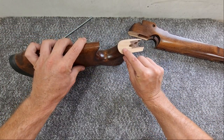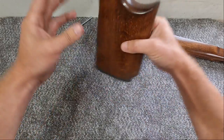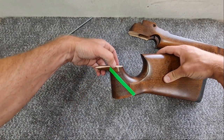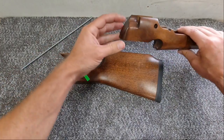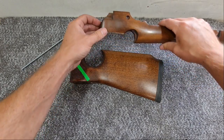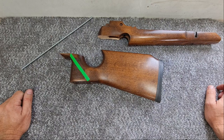There's not an awful lot of wood here with that grip fixing bolt going down at an angle - that's roughly where the stud drops through. So you can see here that I've only got maybe 20mm of wood to get a fixing into, which means I've got to be super careful that I don't break through this back edge. It's going to be fairly involved but I do like a challenge - I thought it'd be fun to film it; it might all go pear-shaped but if it does I'll still put it on the channel.